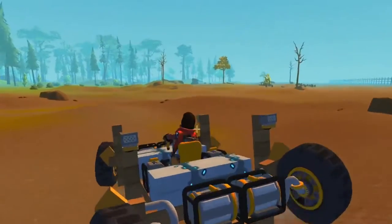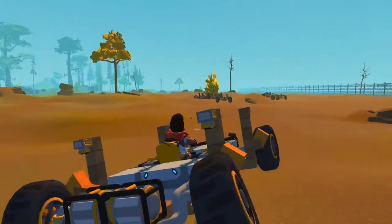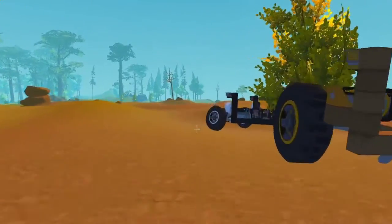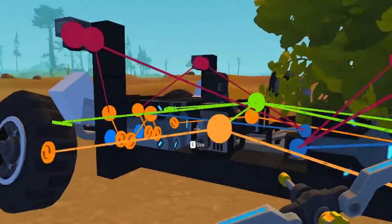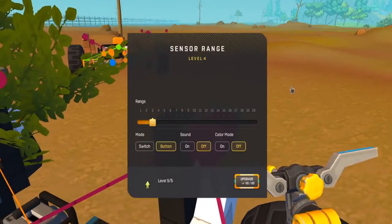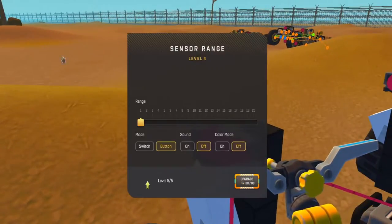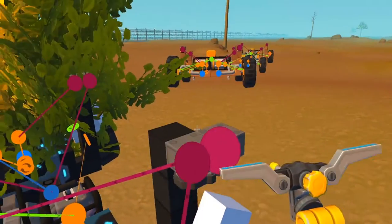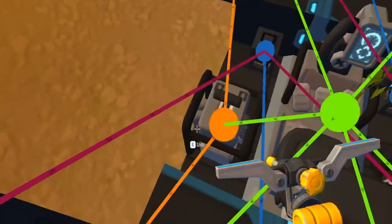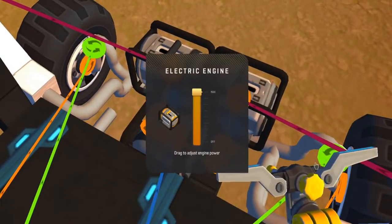But the suspension is kind of an on-or-off thing, so I built the final version. This version actually has two sensors: the normal ones, which are set at range 3, and then there are range-1 ones that are connected into an AND gate.